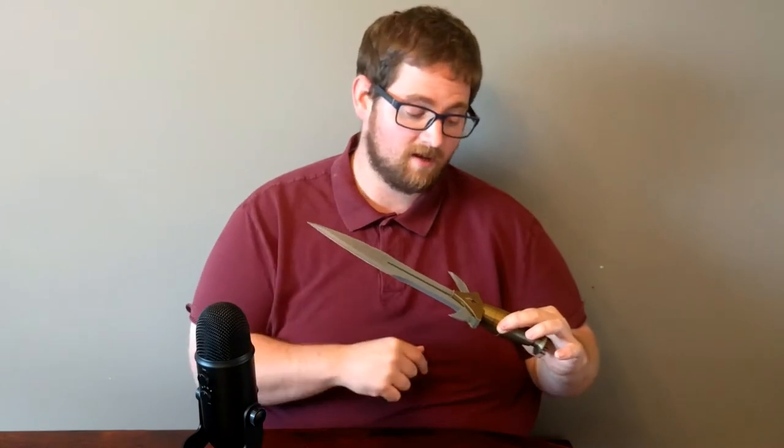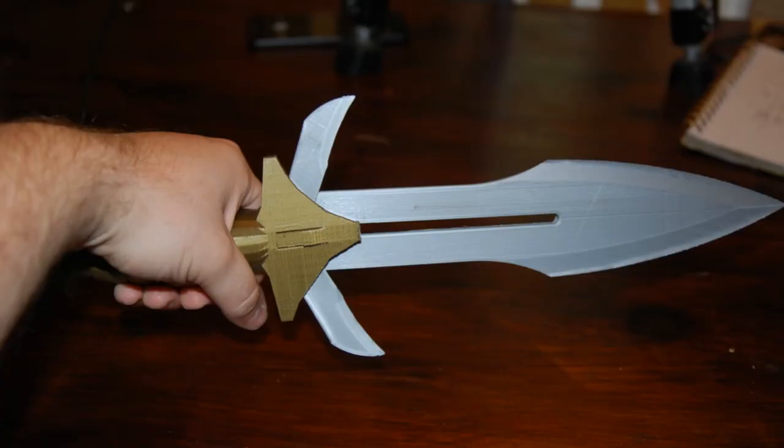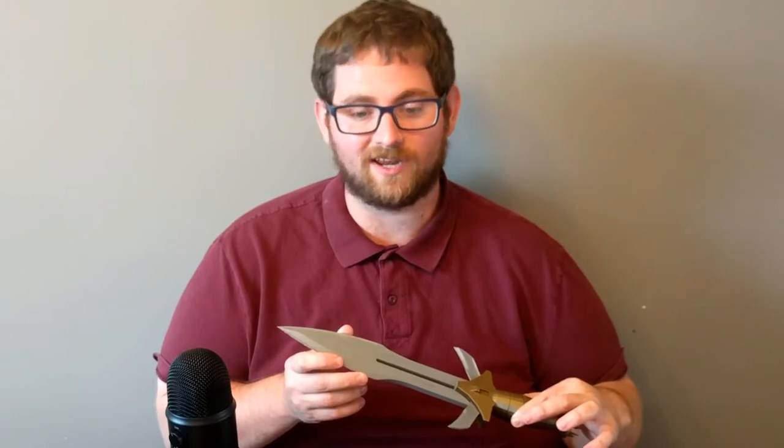This was printed as five separate pieces — three for the blades and two for the handle. The top was printed in silver PLA at 0.06 millimeter layer heights, or 60 micron layer heights, and the handle was printed at 0.2 millimeters. It was printed in a brass-colored — but not brass-fill — PLA as well. The filament used was PLA from filaments.ca here in Canada.